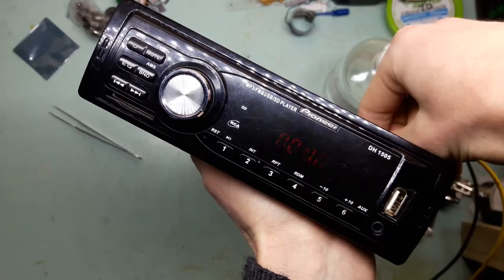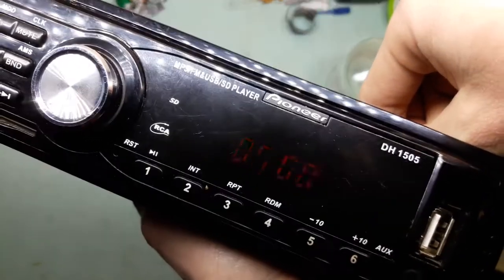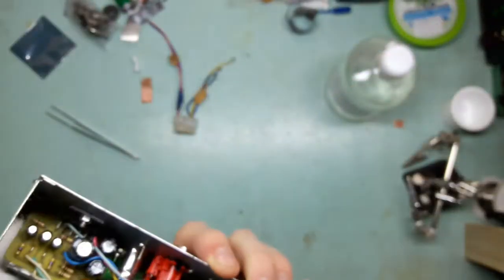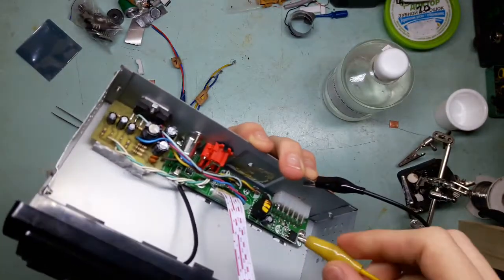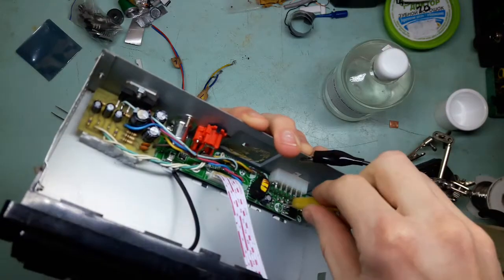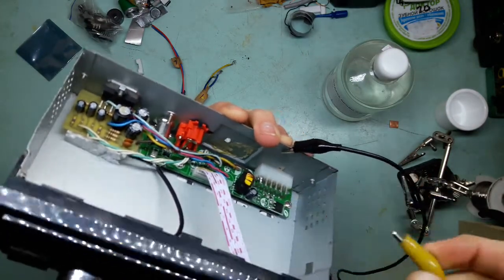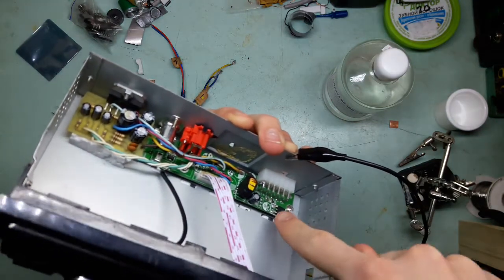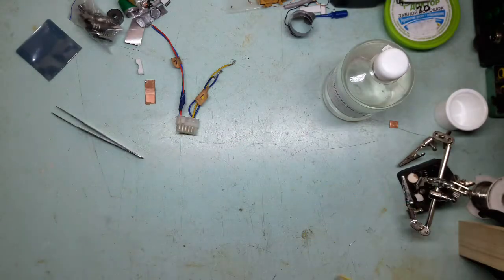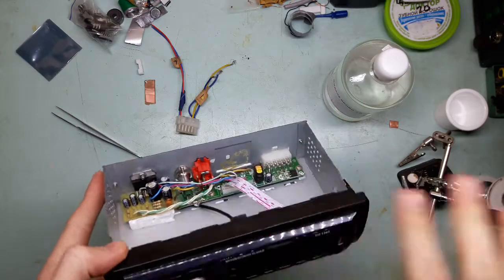The funky flickering is a multiplexing. You do not see that with your own eyes. Kind of a nice effect, actually. And you can also test the voltage regulator by putting the input, the positive from your supply, on the input, and putting a multimeter on the output of the regulator, and slowly bringing the voltage up. Seeing will it cap off at 5 volts. In this case, I tested it and it does.